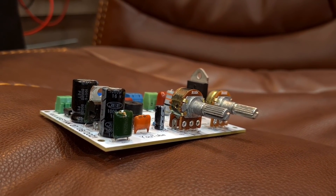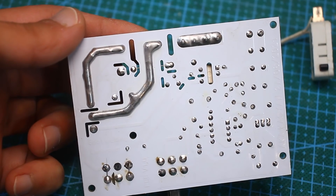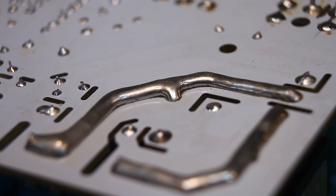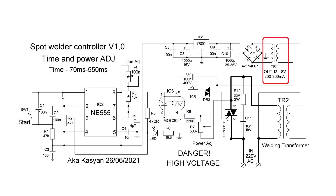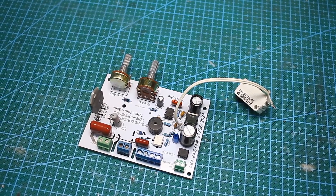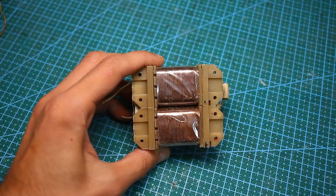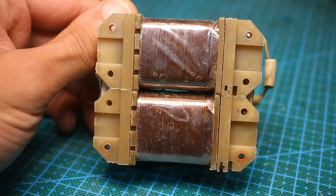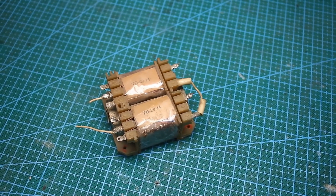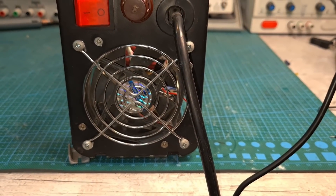The board is double-sided, everything is labeled on it, and there will be no problems with assembly. I will only note that the power high-current pads must be reinforced with copper wires and tinned. To power this board you need a low-current, low-voltage power supply. You can use both a DC and an AC source because a rectifier with a voltage stabilizer is already on the control board. In my case, a low-power mains transformer was used which produces several secondary voltages — two secondary windings with taps. One winding giving about 9–10 volts fits the control system; the other fits a 12-volt cooling fan.